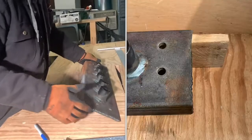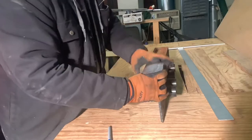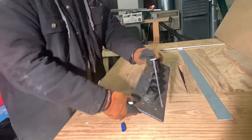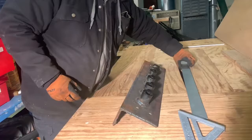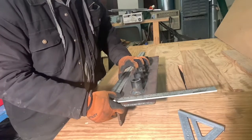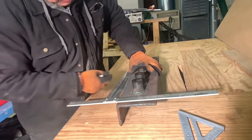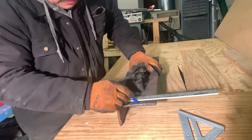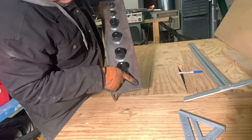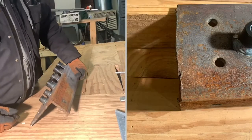What Jay Handy has to do is figure out how to square this edge. We can use the corner and we can use a straight edge. I have a little bit of a problem on this side — it's not going to fit. So what I'm going to use next is a drywall T-square. The straight edge part, the long side — it's kind of a goofy, heavy piece. But once I get that, then I'll make my mark. And this line connects with the line down there. So I got my straight line, and I'm going to have to grind all that down. We come on the other side and basically do the same thing.